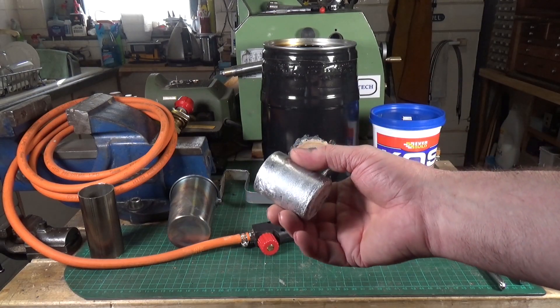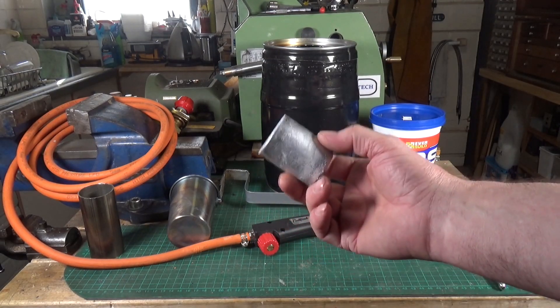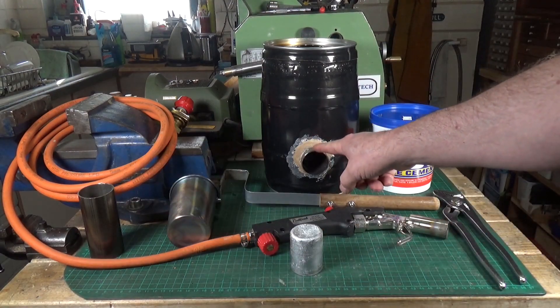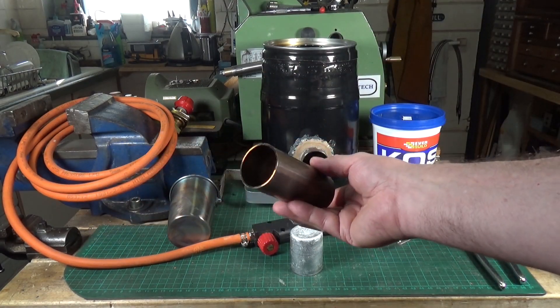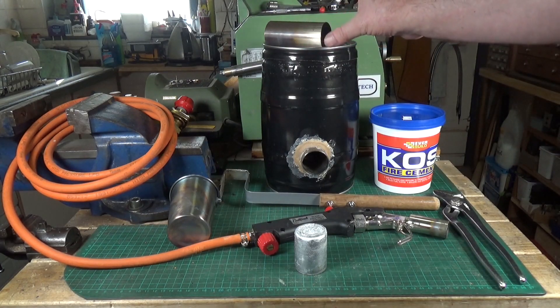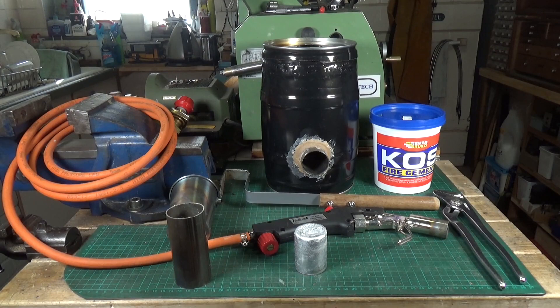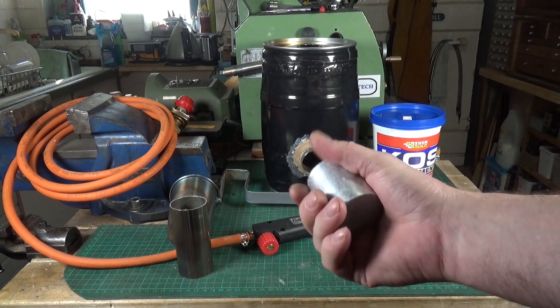The result is a perfectly nice billet of aluminium. I followed Rob's instructions to the letter — I did not keep pouring heat into it, I waited and kept an eye on it, and once it had all fully melted I poured it. I used the leftover bit of stainless steel pipe from the gas inlet as a mould, placed on a metal plate. I had left the mould on top of the furnace for a good ten minutes so it was quite hot when I poured, exactly as Rob said. I just let it cool down naturally and then tapped it on the anvil and it pops right out.